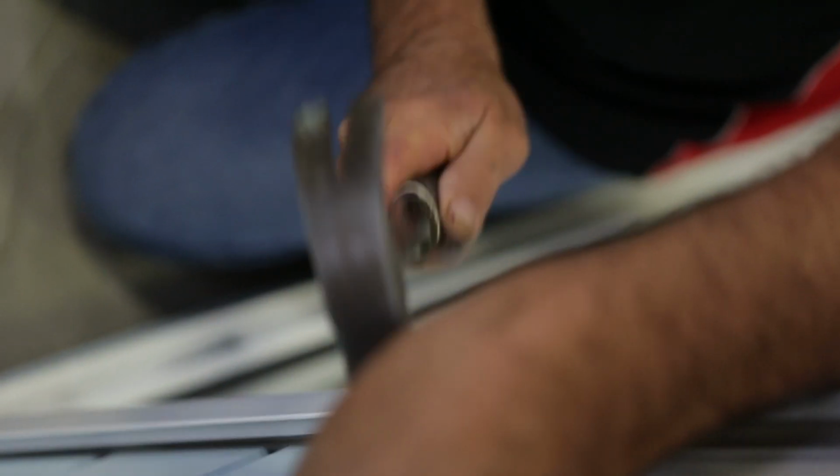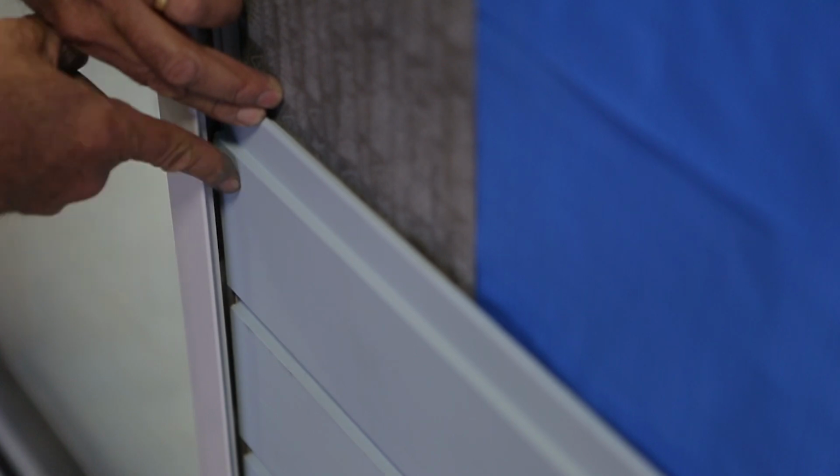It is important when fitting the cladding up to the jambs that the cladding is positioned closely to the door frame, but do not push up on the frame to create a bow. Ideally, we should allow a few millimetres clearance. Gaps should be caulked using a paintable flexible sealant.